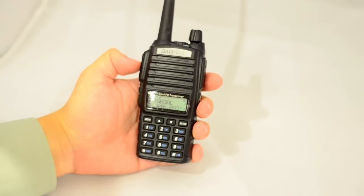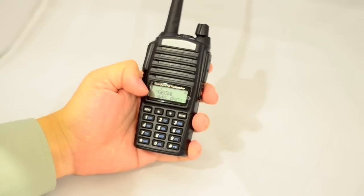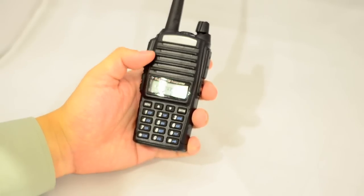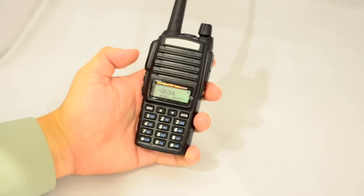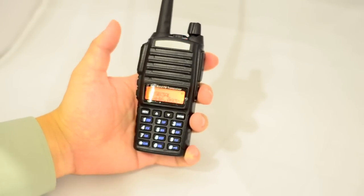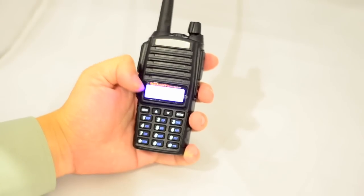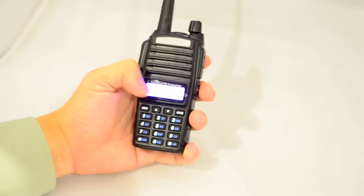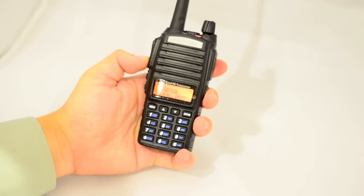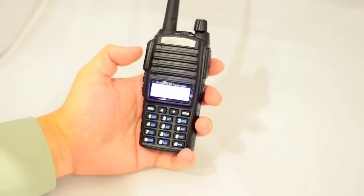Let me demonstrate the A and B button on the side. The little arrow is currently on the top — the A band. If you wanted to transmit on the A band, you just press the PTT. But if you're not sure where the arrow is and you know you have a different frequency on the B band, you just press that button and it automatically transmits on the B band.